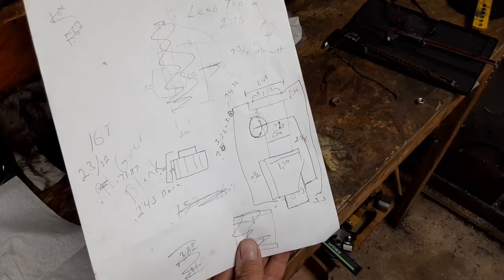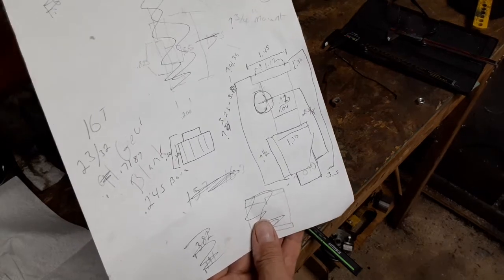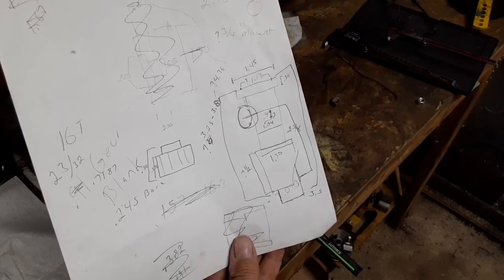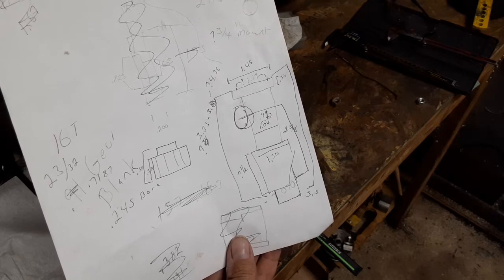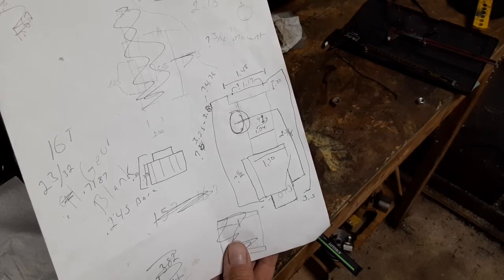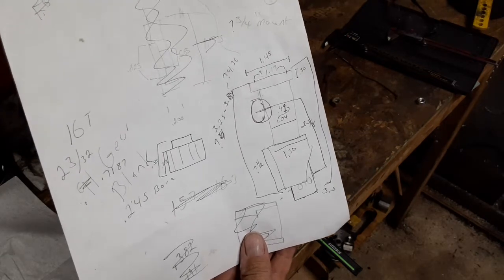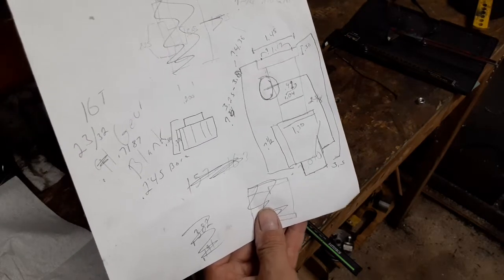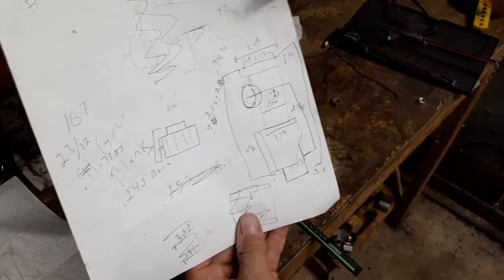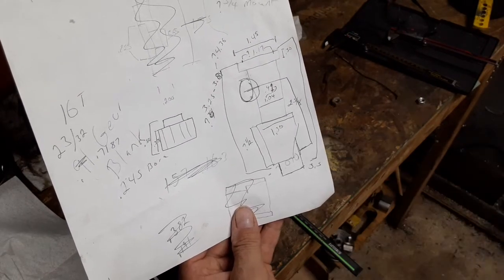I've got a piece of inch and a half 12L14, I think it is, chucked up in the lathe right now that was donated to me by Kimber Zellick. So I think that's the perfect material to use for this project. I spent a little bit of time before I started this video getting the chuck centered up pretty well, so it's only running out about two thousandths of an inch right now. So what I plan to do to start off with is I want to bore, well, drill the quarter inch hole all the way through this thing to start with.